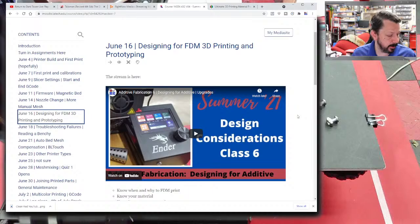One weakness is that a printed part will have different properties than a bulk material version of the same part. I want to mostly talk specifically about FDM — fused deposition modeling, or fused filament fabrication — the process we've been doing with the Ender 3, where you melt plastic and extrude it through a nozzle, laying it on top of itself. Some of these ideas will also translate to other types of printing.